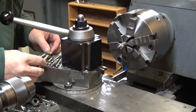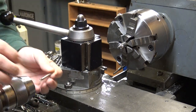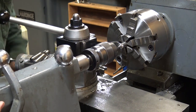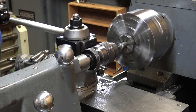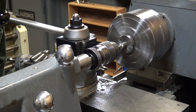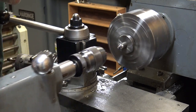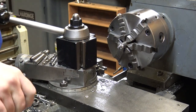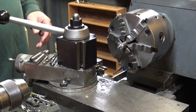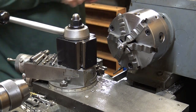All right, like I said, the shaft that goes through the toggle is 5mm, and it's got a 3mm 0.5 hole through the center of it, so the way this lock nut attaches is I've got a little 3mm bolt that goes down through the center of it, passes through, and I make it where the head of the screw locks in. I'll probably put a little Loctite on it when I'm done, but I've got to drill and tap it. I'm just center drilling, getting ready to drill and tap it.